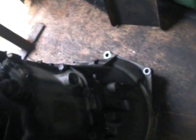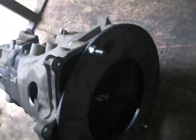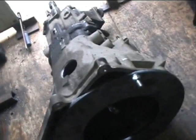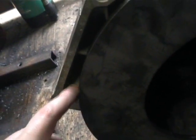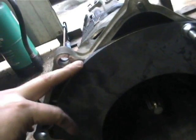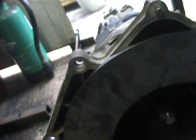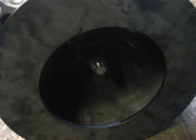I'll just go over here and try and show you this. I've just got two bolts in it at the minute, purely so I can do a few tests. As you can see, we have a nice 8mm steel plate there on the gearbox bell housing. Now, as you can probably see, it misses these two bolts here — that's just because of the size of the thing. What I'm planning to do there is to take a little piece of flat steel and just bolt it through there, and that'll do the job. As you can see it's a perfectly flat surface — it's a fair bit better than what I had.